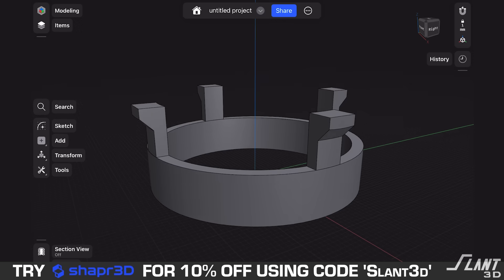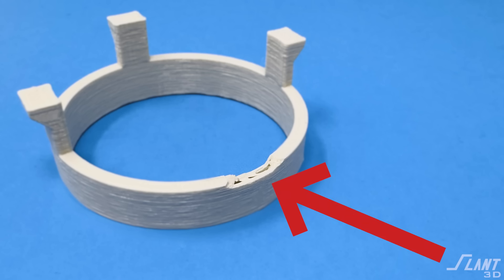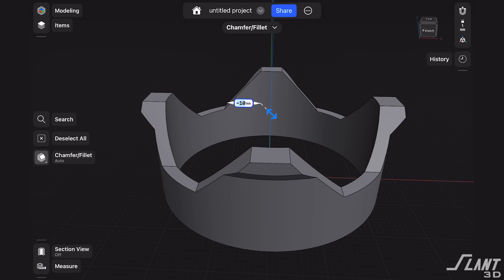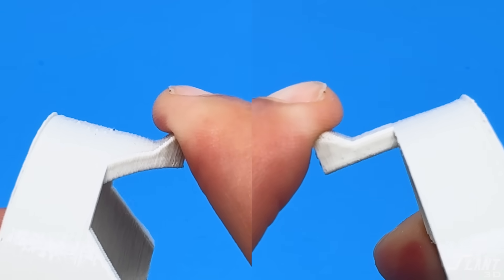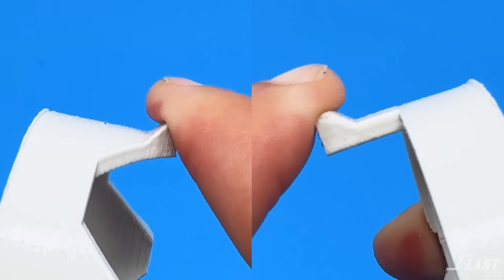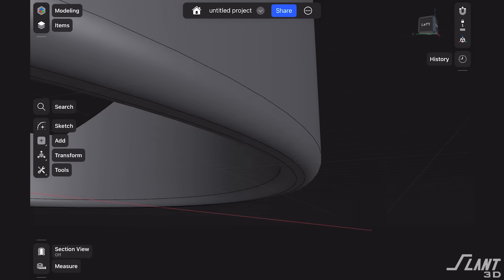The other thing you can do is make minor modifications to the design. The point of failure is those clips, so if you want to reinforce them you can add chamfers to the outer edges so that they are actually reinforced and able to stay there. In that way you're losing some flexibility and have to rely on the flexibility of the ring rather than the clips, so it's not always a good option. Also, make sure you're filleting the lower edge that's in contact with the bed so you don't have to worry about elephant footing or other first layer artifacts.